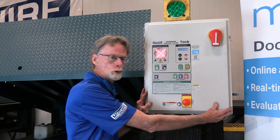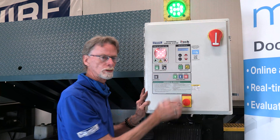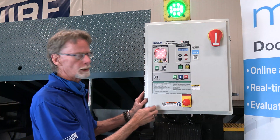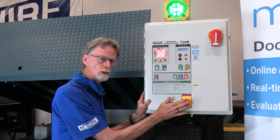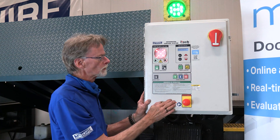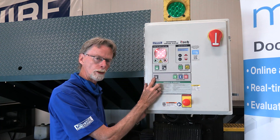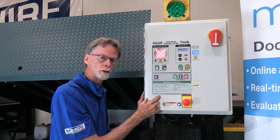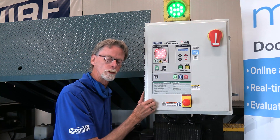This is a quick look at the iDOC controller we talked about before — the integrated control system if you want to get fancy with a restraint and the dock leveler. Not only that, you can add other features as well. The one feature is the e-stop, and the other is the lip-out. Not only can you do those two, you can actually install a dock light and work the dock light from this. You can also have your garage door operator incorporated into this control box — open, close, stop. So there are a lot of advantages to the iDOC control system.